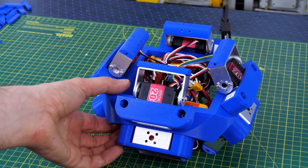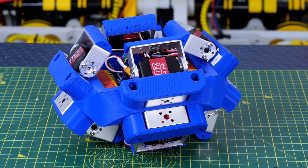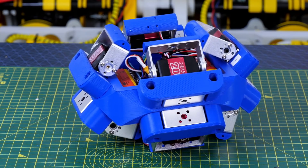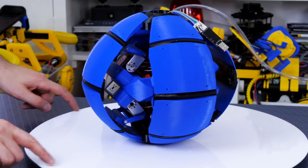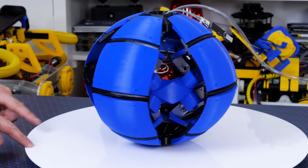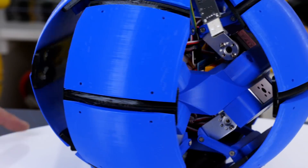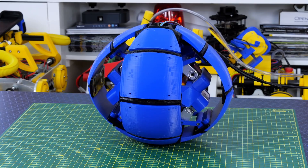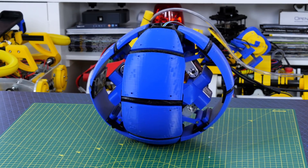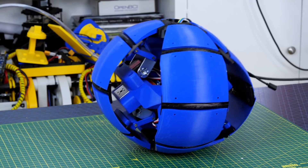Although it's not actually going to be able to do that pattern because the ball can't stretch. To roll along it's going to need to morph the ball without stretching any of the sides. The mechanism is suspended inside the ball, attached with servo levers from the pivot points on the servo brackets to some extra pivot points fitted all the way around inside the ball. That same morphing pattern doesn't need to stretch any of the sides so they move freely. I don't think that's enough to make it roll along though, so here's a more extreme version — we can see quite a lot of morph there.